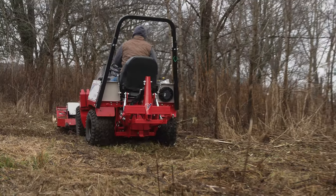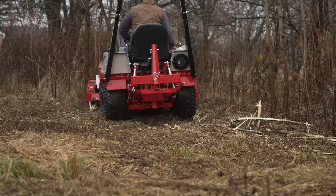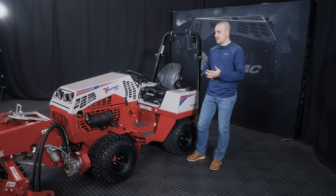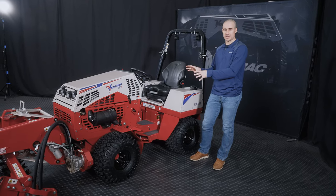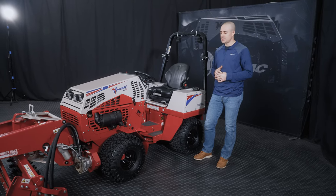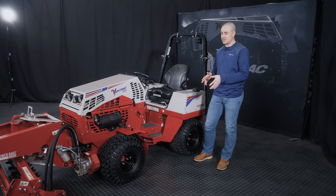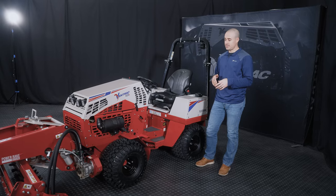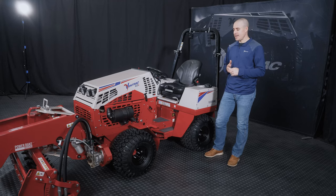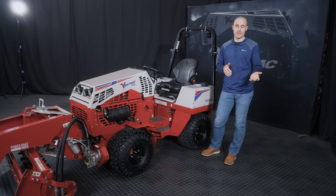But that's very critical to make sure you use dual wheels properly. The next thing I want to highlight is the sealant that we offer for our tires. So we spec these tires specifically for the rubber compound, the sidewall flex. Everything about them gives them the right performance that we want out of the machine. But because we've chosen a few aspects of the tires, we've given up the ability for them to be bulletproof. So they're not fully solid, they're not foam filled, they're not like construction tires that have sidewalls that are ridiculously thick. And for that reason, we run an internal tire sealant in applications where you might face flat tires.